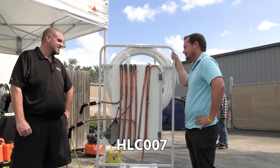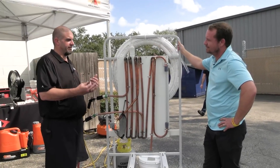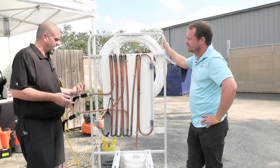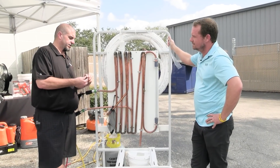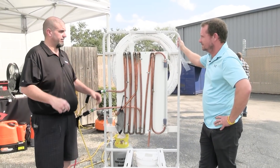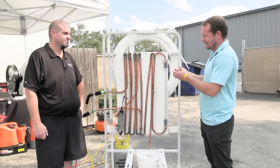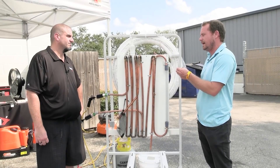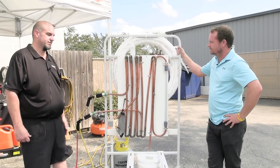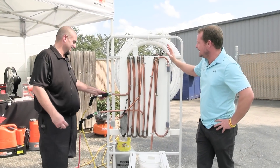A lot of people have asked how long the pigs last. We really don't want to put a firm number on it, but depending on the line set and how it's set up, if it's a good clean line set you can probably get about 10 uses out of it. We're pushing pigs at least five to six times through this line set and seeing some deformation, but nothing catastrophic. A big key to making them last is reaming the tubing and deburring it, so it doesn't score the edges. I purposely did not do any deburring on any of this to make it realistic for the kind of stuff you're actually going to find — it's got a hideous solder job on it and everything.